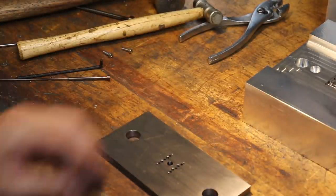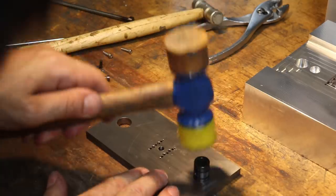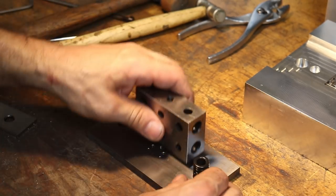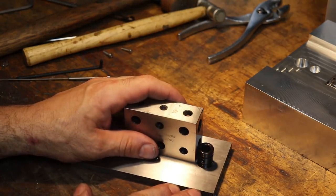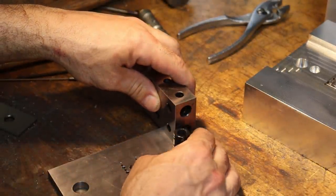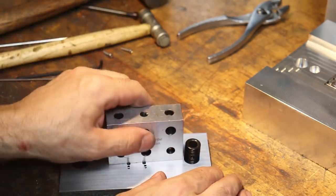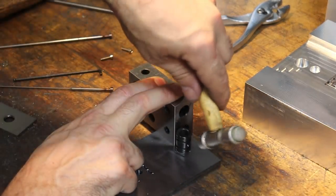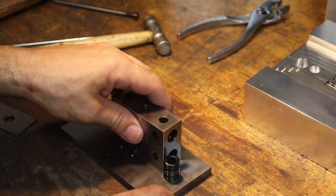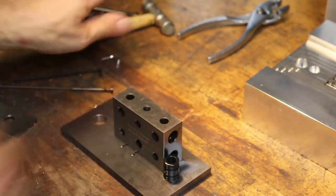Okay, and these are more basic bearings. They're basically just hard anodized aluminum tubes. You do have to be careful about starting these square. So I'm gonna get a 1-2-3 block, and we are gonna check squareness. So we're square that direction. Because these aluminum plugs, or bearings, can start crooked and just start gouging away the aluminum. Whoops. Guess we could do it that way. Once I get this started square, I'm gonna go over to the Kurt vise and just press this guy in. I'll do that off camera, so I'll be right back.